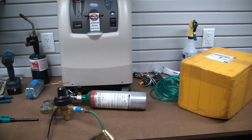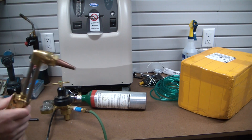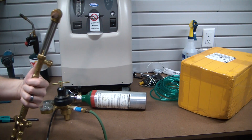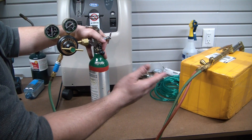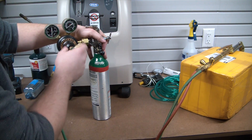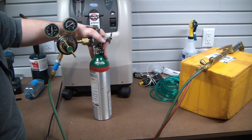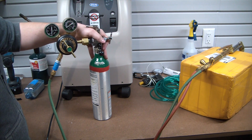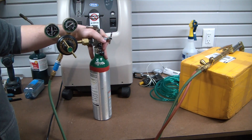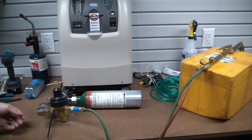The tip I have was not designed for oxy-propane — it's an oxy-acetylene tip, so it's very much not the correct type, but it'll work in a pinch. Now, oxy-propane is actually not great for welding, so it's really limited to cutting. What I'm going to be doing is obviously rocket engines — hybrid rocket engines — and I'll be showing you guys an old one I built many years ago in an upcoming video, where we'll test it with some oxygen and get it fired up.